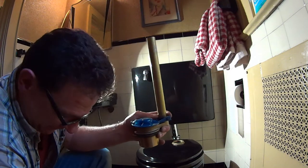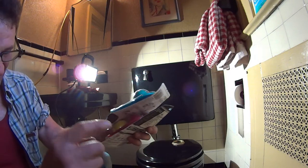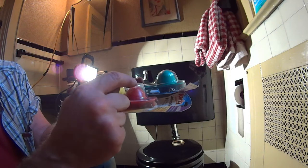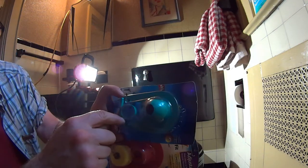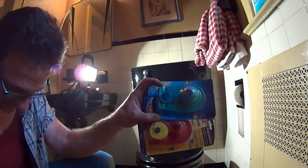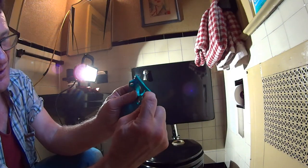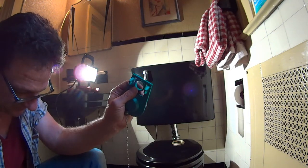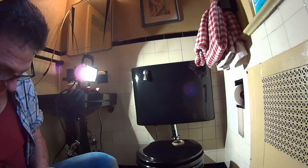What I have in the truck is a couple of different universal flappers, and I'm going to eyeball the profile. This one looks really smaller and that's going to be a good bet, but I'm going to eyeball this one first too. This one comes with a built-in rubber collar already attached. With these, because it comes with this thing built in, we could cut it here and use it in a regular flush valve with plastic ears on it, but we might as well just slip this off and slip that on as an assembly.